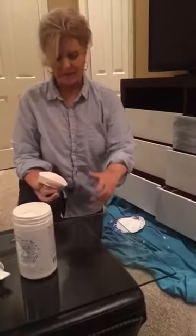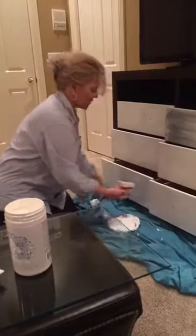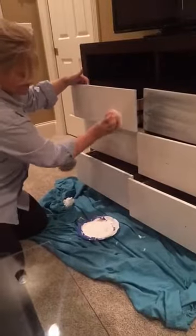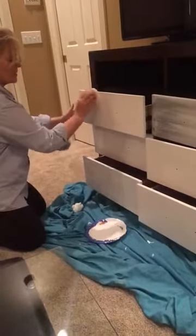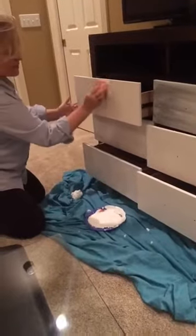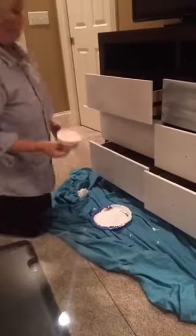I'm also going to show you how to paint the glass top. We're painting on the back side of the glass, and then of course it's totally protected because the paint is underneath. Back over here — I'll put on one more coat here and it is dry enough. You can see how much brighter and whiter that's going to be. You're probably thinking that's going to show all that texture from the sponge, but it really doesn't. Paint is full of water and when it dries it shrinks, so all of that risen texture you're seeing will go down and go flat. It gives you a manufactured look rather than a brushed look — much prettier, more even and consistent.